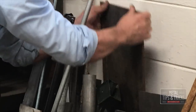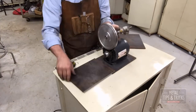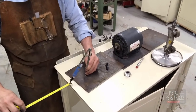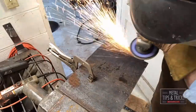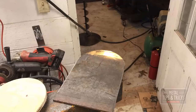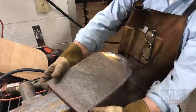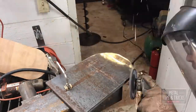Now here we are looking for some scrap metal. Like I said, this is a scrap metal project, and every scrap metal project starts out on the bandsaw. We're trying to size this. You can see why I ended up building the pulley first — I needed to make sure I could fit this all in. I didn't quite have enough steel to make this so we're going to weld it up, add some metal to it, grind it down, and get it fitted. I want to cut this radius and the best way for me was to do it with a plasma cutter and a wood template. We match up the two pieces, clamp them together, and grind them until they're the right fit.